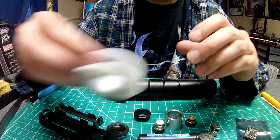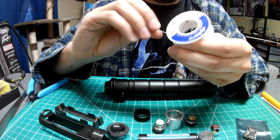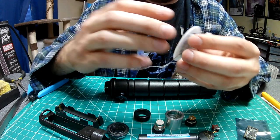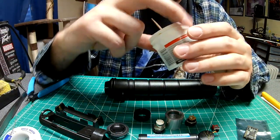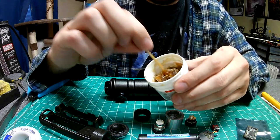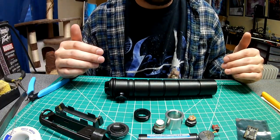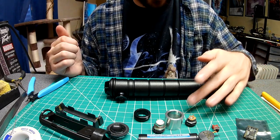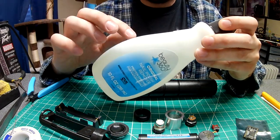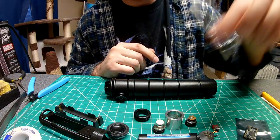For tools: a man is only as useful as the tools he has and knows how to use. The solder I use is Alpha Fry 60-40 with a rosin flux core. I also like to add extra flux with a toothpick — it seems to help the solder flow a lot better. For cleanup, I use a half-and-half mix of nail polish remover and 90% rubbing alcohol applied with Q-tips. Flux left on PCBs really bothers me.